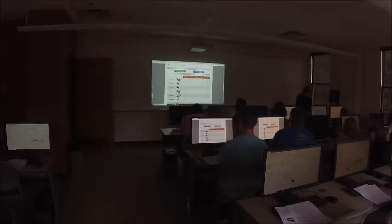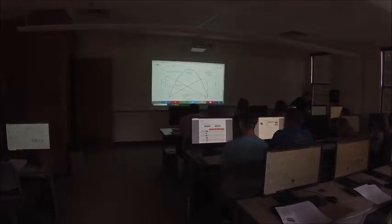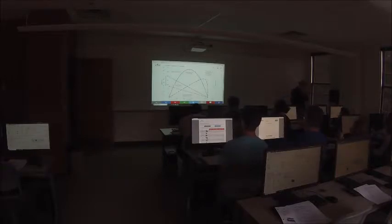Okay, so I'm going to click on this and it's going to give us a lot more information here. This is the same graph that's printed on the back of your sheet, but it's a little easier to see here. So basically, when you're looking at how fast the motor is moving and how much torque it is producing at any one point in time on your robot, say you're accelerating your drivetrain, you want to know how much torque the motors are producing at any one time, or you're moving an arm, basically all of the performance data about the motor is related to speed. So as the motor speeds up and slows down, the power output, the torque, the current it's drawing, all of those change in relation to speed.